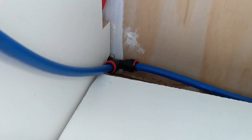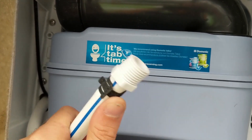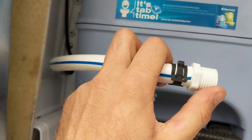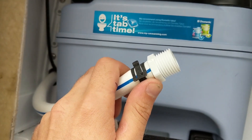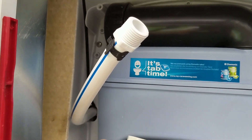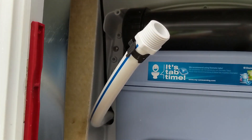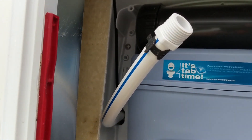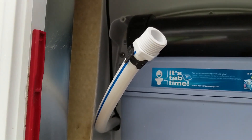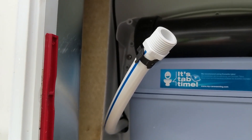Here's the cold water going to our shower, and then it goes off behind our shower cubicle over to our toilet. The water connection for the toilet flush is a half-inch NPT, which is an American standard — in Australia all we can get is BSP. Apparently they're not really compatible except at half an inch, where most of them are the same. So I'm just going to wrap this in thread tape and put our John Guest half-inch BSP on and hope it works.